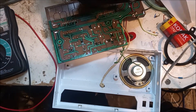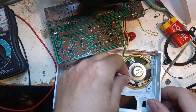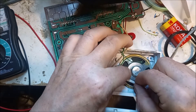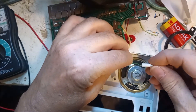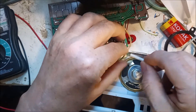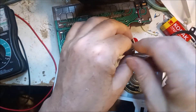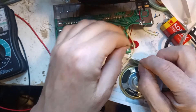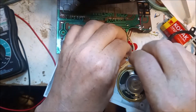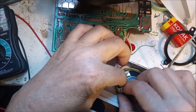So in fact it's an 8 ohm speaker with a 68 ohm resistor in series with it, with a bit of heat shrink sleeving to prevent any short circuits. By the way, the speaker in this instance is not polarized — you don't have to worry about phasing or anything of that sort. It's not something considered relevant with a stylophone; it's a simple device.